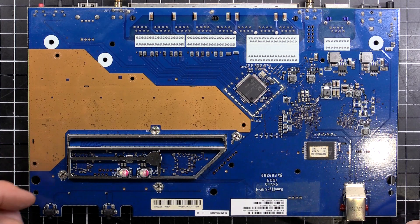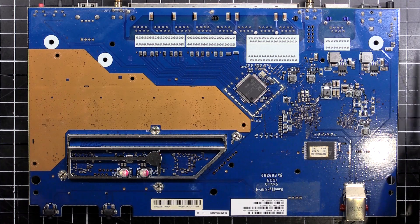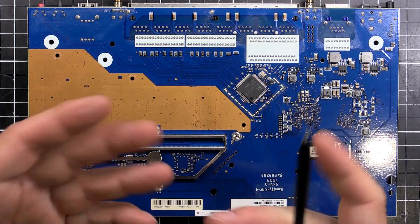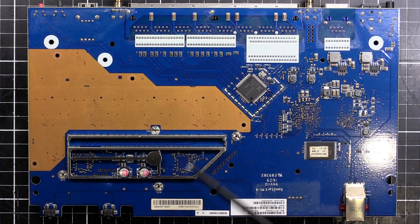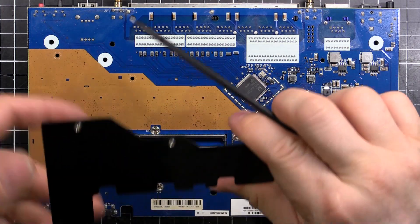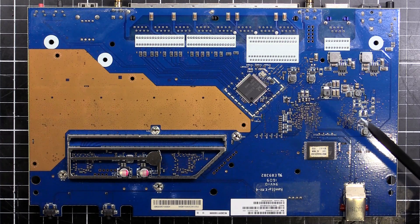Good news everyone — we got in. I left one of the caps on the other side because I didn't want to push my luck. Pulling this cap off, it's just got two power supplies — two capacitors, two inductors and two little control chips, just for various voltages needed. The reason they put this cap on is for shielding. If you have a circuit that's going to be radiating and you shield the top, it can still radiate out the back. So they've put this cap on to stop that, and along with this big copper plane and this heat sink acting as a shield, that stops any radiation coming out the back.